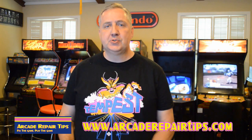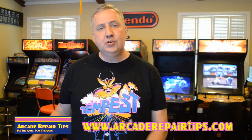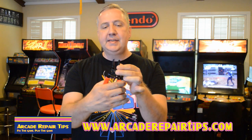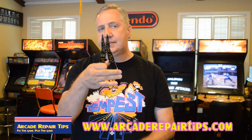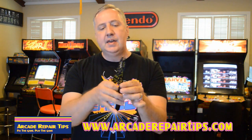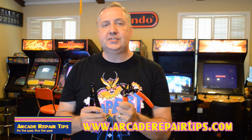The first type of wire strippers we're going to talk about is a more traditional wire stripper, like you probably noticed we used in our early videos. I have two right here that are pretty similar. The first one has a spring in the middle — you just put the wire in and pull it. This one does the same thing, except it has a couple of extra features: a plier end on it, and a place down here where we can crimp something on. We'll show you that in just a little bit.